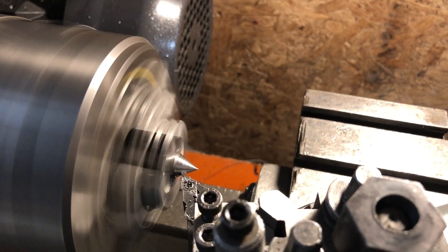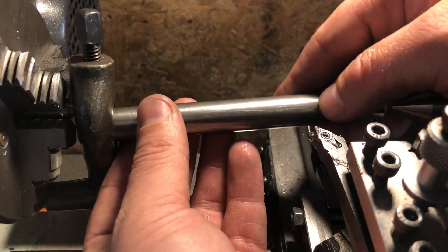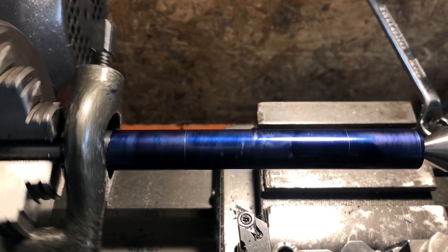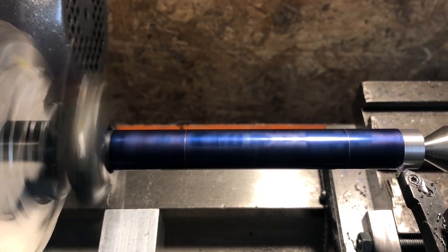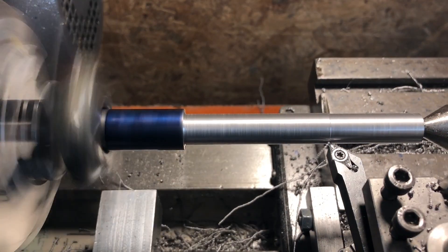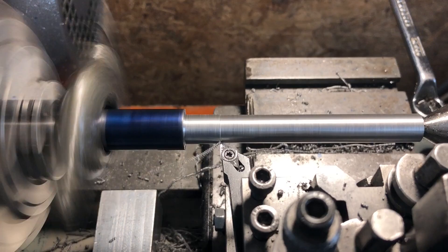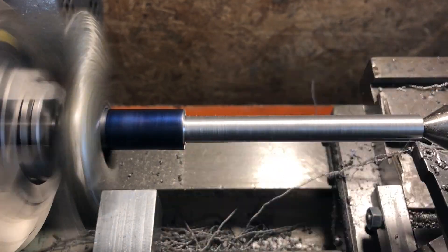The next job is to true up the centre in the chuck and then mount the shaft on the lathe. Here it is set up and I'm going to turn the three-eighths section that will run in the sleeve first. The length is marked out using calipers and a carriage stop, followed by the tedious task of adjusting the tailstock to turn parallel. The wear on this lathe means it's not possible to adjust the tailstock with no play yet still movable along the bed, but once adjusted and locked, as long as I only use the quill to remove and rotate the work, it is fairly repeatable.